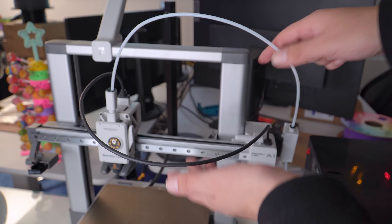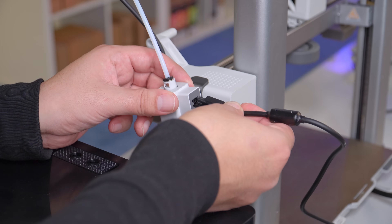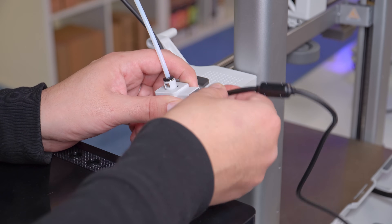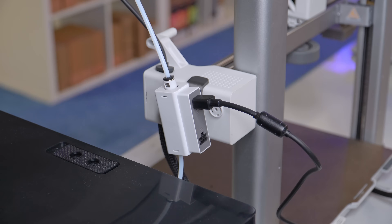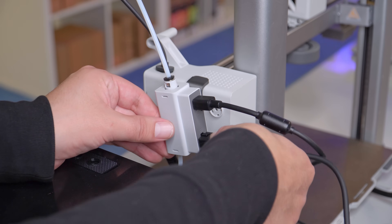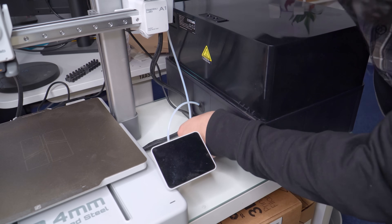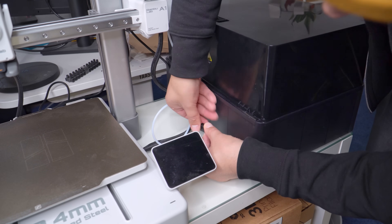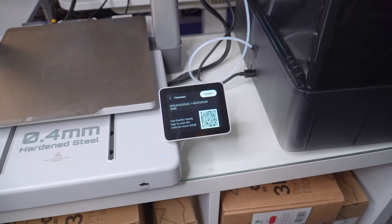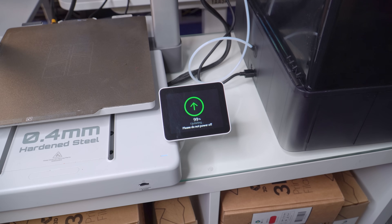Now is a good time to put that tube clip back on so the power and data cable don't flop around. You also received a 4-pin cable with the new hub — that one goes into the back of the new hub, and the other end to the printer. With your AMS, you would have gotten a 6-pin cable which goes into the back of the new hub, and the other end goes to the AMS, where there are two ports — choose whichever. The second port is for daisy chaining extra AMS units. If you haven't updated your firmware already, now is the time. It only takes a few minutes, and when it is done it will reboot, and irritate you by saying it's still not done, until it is done.